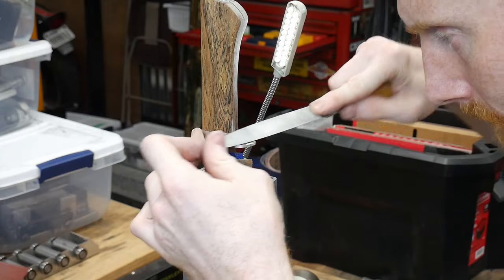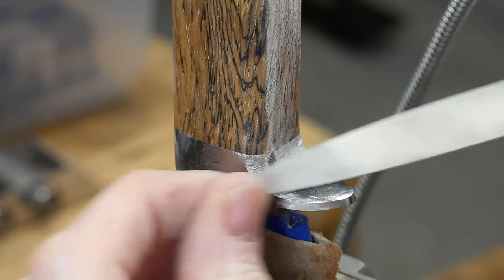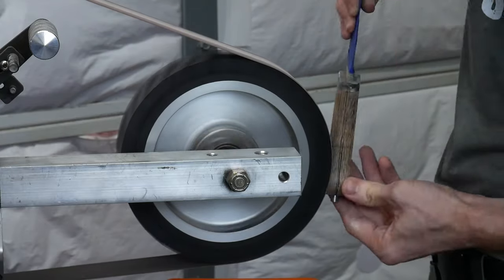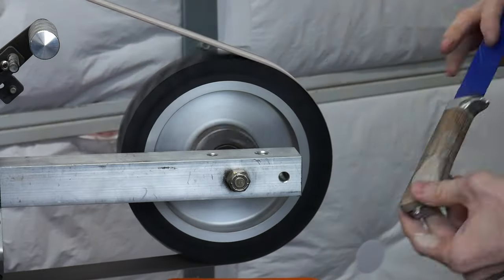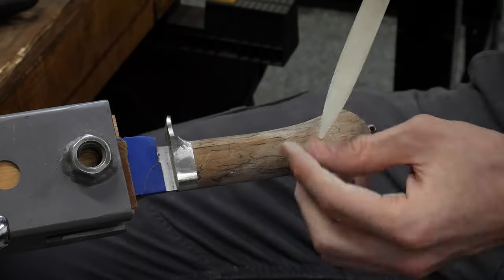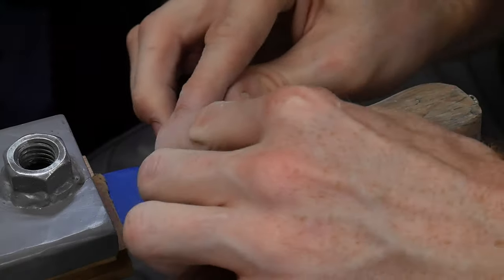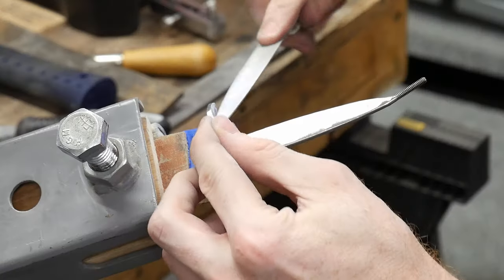The challenge is to keep this transition fairly crisp while not over-filing on the soft wood at the transition. I'm using a sweet six-inch Grobet file that I recently purchased — we'll put a link in the description below. Once I have the bulk of the filing done, I use an eight-inch contact wheel on my 2x72 belt grinder to give my handle some contours. I move back to the six-inch file to get the swells even and symmetrical. I spent a ton of time on this handle — it ended up being a bit bulkier than I had planned; I should have tapered it towards the guard.